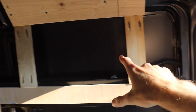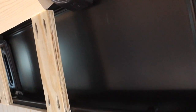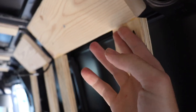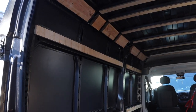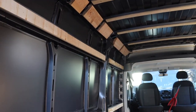I'm actually pretty happy with how this went. The Kreg screws went right into the corner of the two-by-six and had all that wood to bite into, so it's way stronger than I thought — it's actually shaking the whole van. Tomorrow I'll finish up on this side, and I'm going to make sure that side is especially strong because it's going to be holding all of the overhead cabinets.